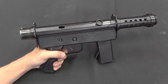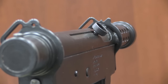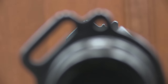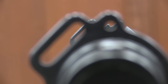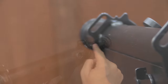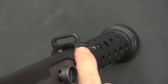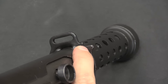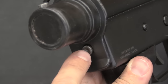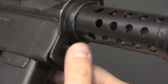With the barrel now out, we can separate the upper from the lower receivers. You'll notice on this receiver tube we have a pair of flat steel plates that have been welded into place. These contain the sights — there's our rear sight aperture — and also the sling swivels. There's the rear sling swivel, there's the front one. That thing doesn't even count as a front sight blade; it's more like a front sight nubbin. But that's what it's there for.